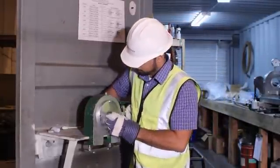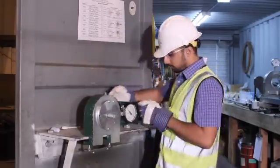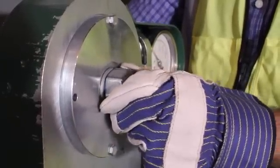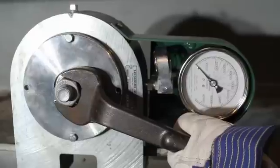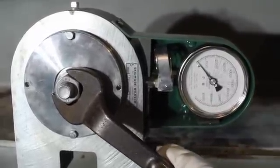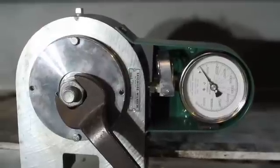Make sure to install the nut on the bolt such that the first three to five full threads closest to the bolt head are between the nut face and the bolt head. We are using washers to achieve this distance. After the fastener is properly placed, tighten the bolt to the desired load. For a seven-eighth inch diameter, the initial tension should be four kips.